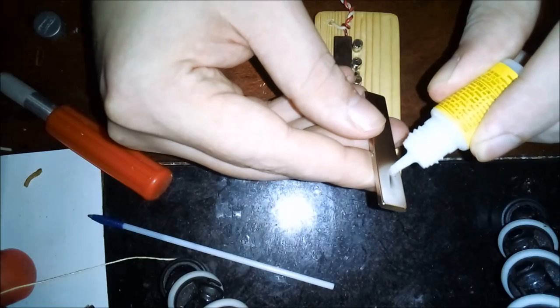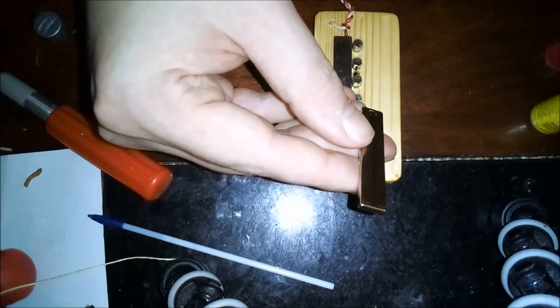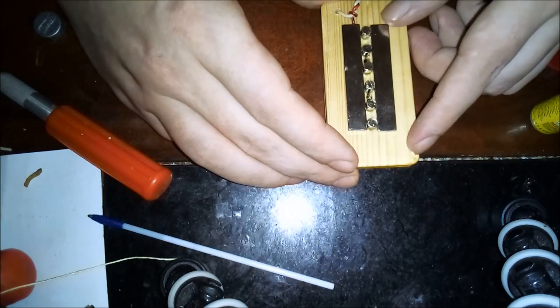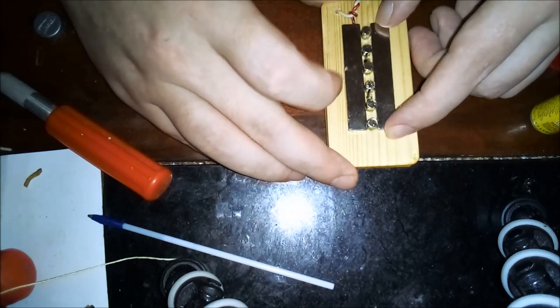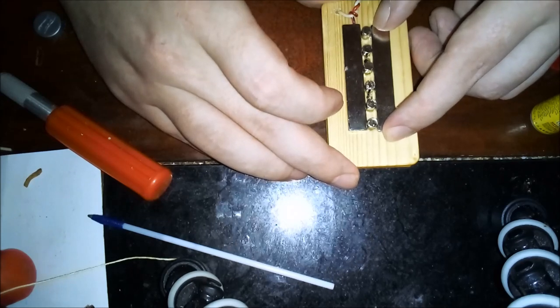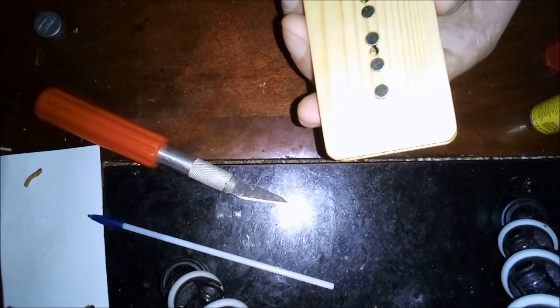And now a second magnet for 32 pounds of pull. That's gotta kill the sustain, right? Not as much as an Alnico pole piece. So the pickup's hooked up to the amp, and I tap it and move the magnet until it makes the highest output. And we have a working pickup, although very microphonic.